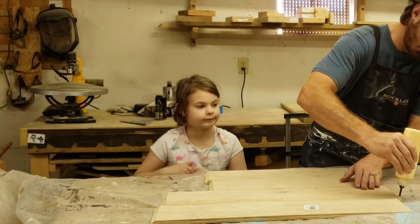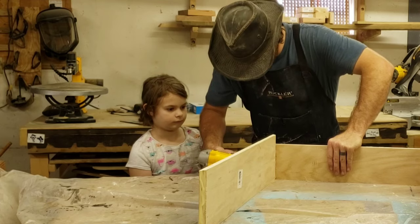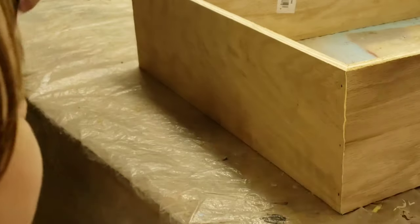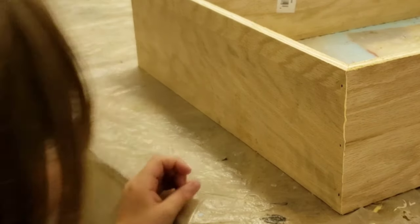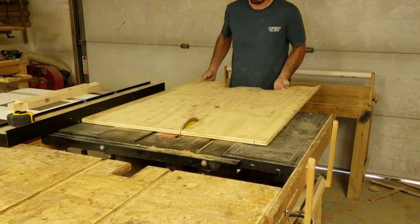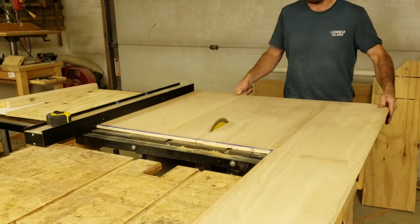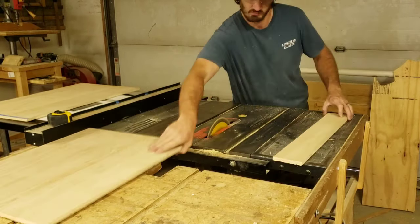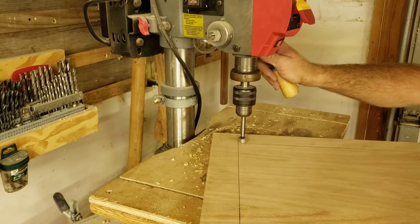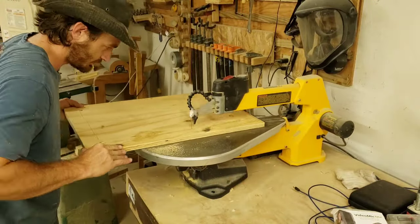This box needs to be three individual layers. The first one is going to be the baffle for the front, and the other two are going to be the housing for the furnace filter. Both of the latter two can be cut square to match the furnace filter, but the baffle has to be cut round, and all of them have to fit inside the box. I used a scroll saw and a drill press to make the cutouts accurate, but you could just as easily use a jigsaw.